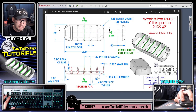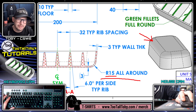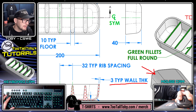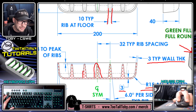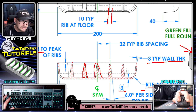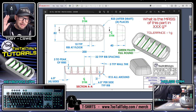There's a 25mm fillet and a different fillet down at the bottom going around all sides - different fillet radius, something to keep in mind while planning. Once I have the main shape, I can run a shell to shell the whole thing out at three millimeters. Then the last thing will be the ribs - they're defined as 10 millimeters at the floor, which might be a challenge with the rib command. It might be more natural to draw from a side view and extrude up to next, then finish by adding the tangent full round fillet. Green fillets are all full rounds.